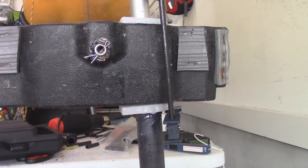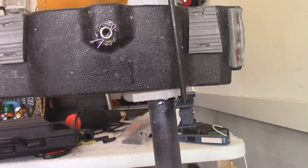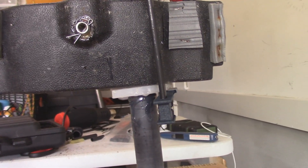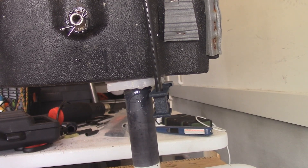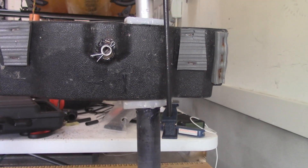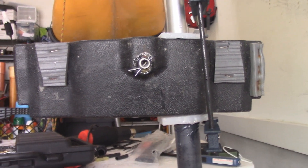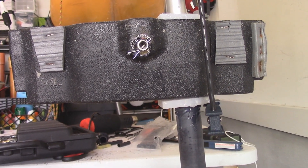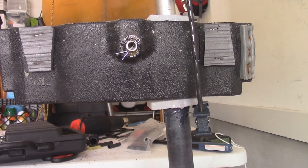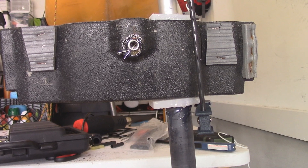If you use the metal bar like I did, you can't run the shaft right through the middle of the cassette — which I think is actually fine, because what I've done is offset where the shaft enters the cassette, and it makes it easier to get in and out on the water. Like most of you, I have filled the cassette with expansion foam, which makes it a little more soundproof and rugged, and lets less water in. Once you have it set in place, I recommend you put some epoxy on the side of the metal bar so that water doesn't enter the cassette while you're on the water.